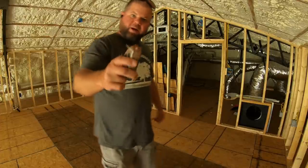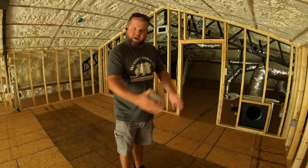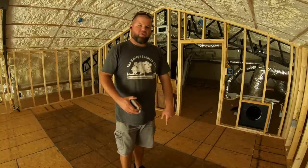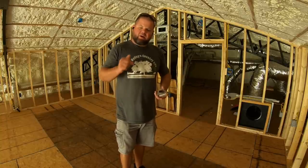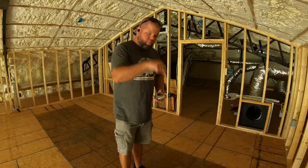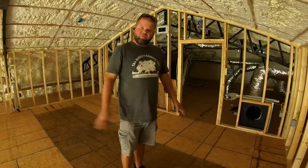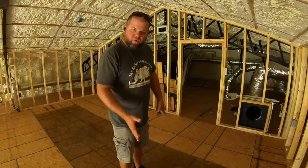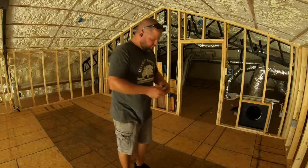All right, so now I'm going to take my chalk line and transfer all the marks that I made on those bottom studs where every floor joist is. Transfer that line to this OSB, snap it and mark it. Now I know where to come back and nail through both sheets all the way down into the floor joist. This should make an unbelievably strong and hopefully squeak-free floor. It's glued, screwed, and now I'll nail it.